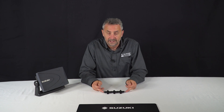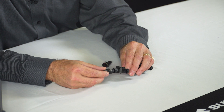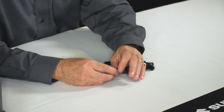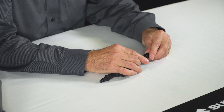We've built the first part of the backbone and importantly we need to put a small resistor on each end. These come in the box — there's a male and a female. The female goes on one end and if you just turn it gently you'll feel it lock into place. It's critical that these are fitted, otherwise the system will not work. Then the male one goes on the other end. As simple as that, we've built the backbone.